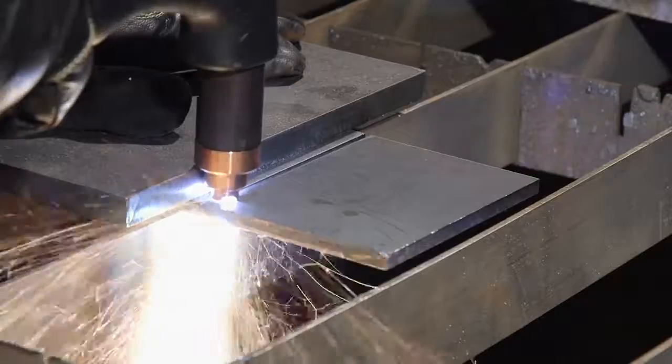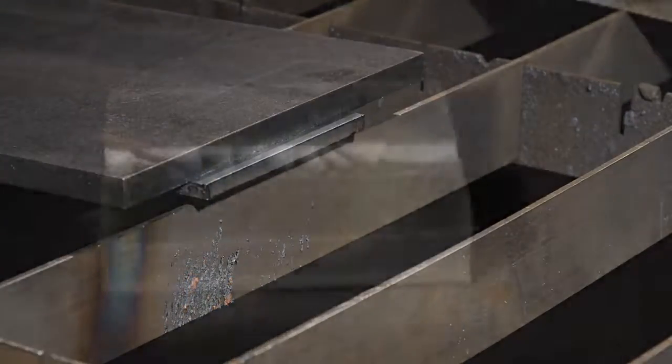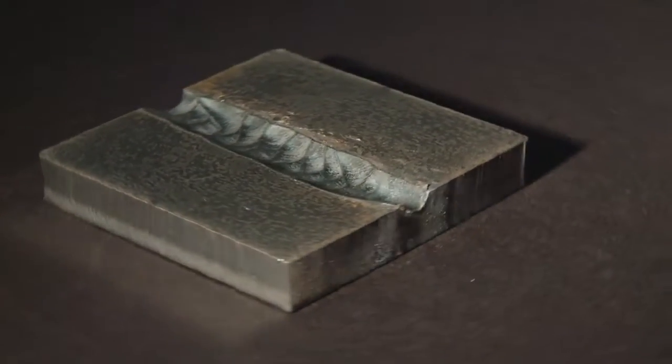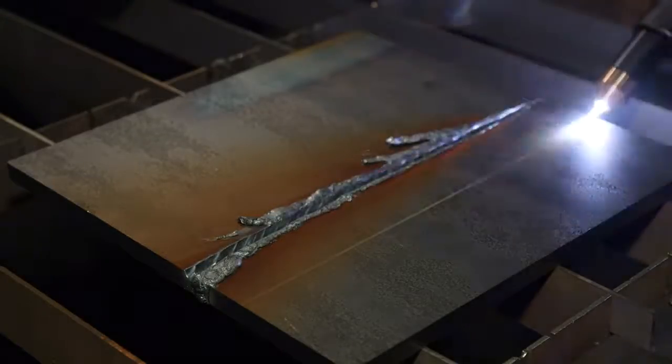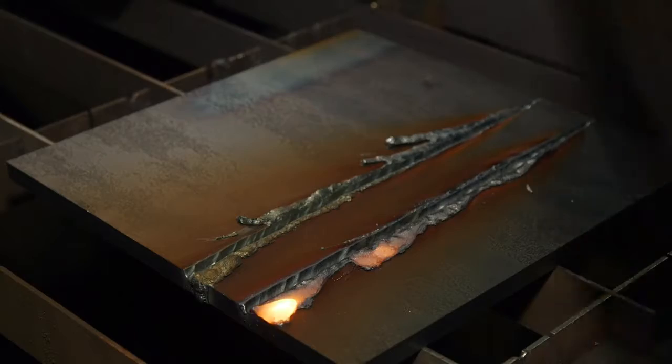Cut and gouge quality, as well as consumable life, are very important factors for operators. There are a number of things that will determine cut and gouge quality, as well as how long the consumables will last. Air quality, piercing technique, length of cut or gouge, operator skill, material thickness, and material type all play a role in consumable life.